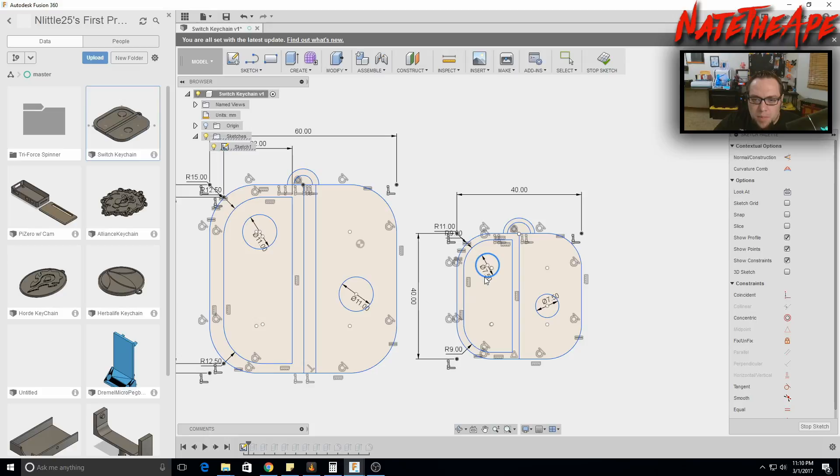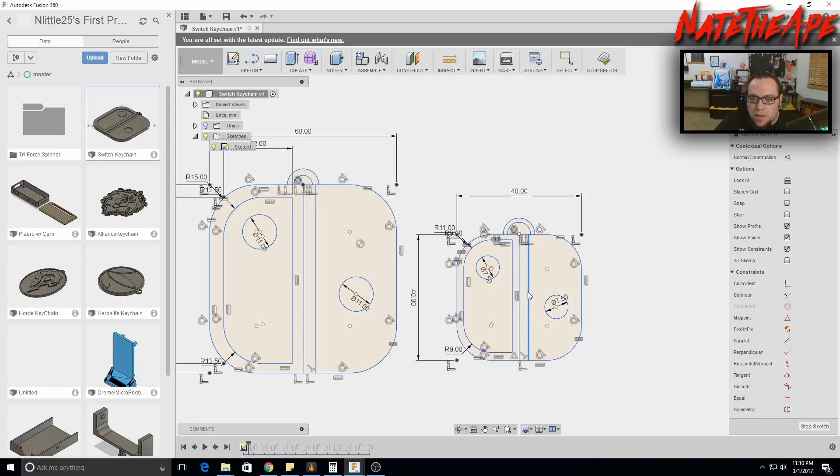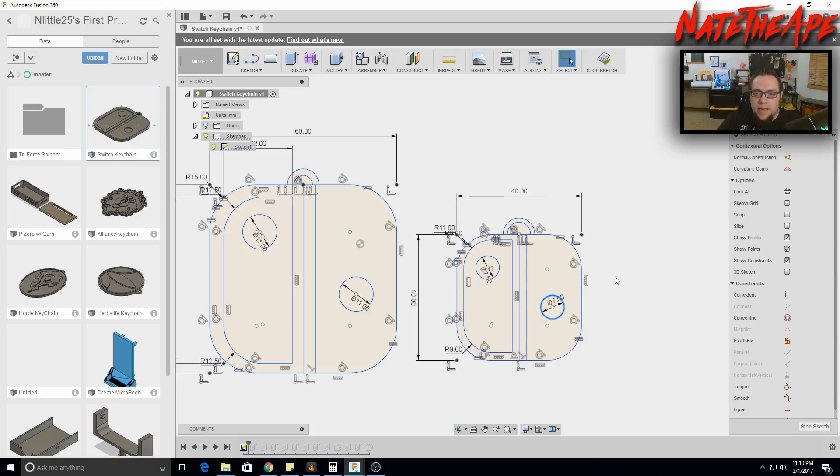The circle midpoint on this side starts right about where the fillet begins. We're going to shift things over slightly because we need one more line in the center. Draw that line, drag it down so it's perpendicular — shown by the small blue square — then hit Escape. We can now adjust positioning: keeping the circle a bit higher since, as noted, these aren't exactly mirrored. With that, we've got both sketches complete.